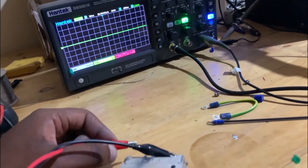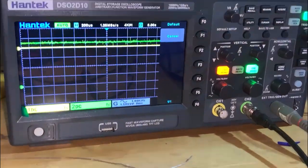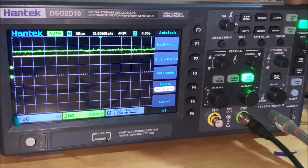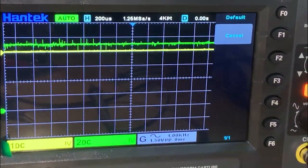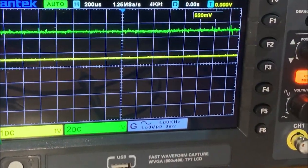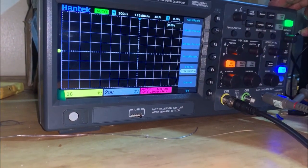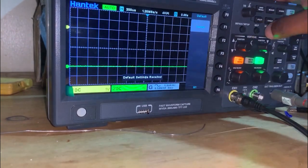Results were good on the oscilloscope, but as you know, it is almost impossible to get a very pure DC output signal due to the ESR, equivalent series resistance, from a capacitor that is not new or spent a long time in stock. I hope you found these guides useful, and you can follow the same process to fix your power supply as well.